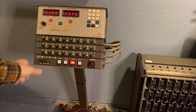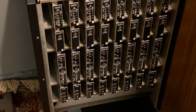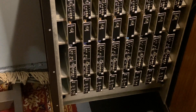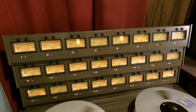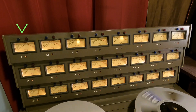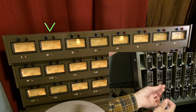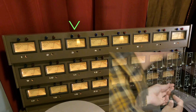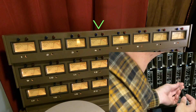I'm going to come down here and go to the cue card. We're going to play the 10k tone and I'm going to adjust the 10k on the cue card. 10 kHz — number 1 looks pretty close. We're going to go to high speed, high frequency. Channel 1, bring it down a little bit. Channel 2, same thing — down a tad. Channel 3, channel 4. It's all just a little flaky and high. Channel 5 looks good, we'll go to 6.